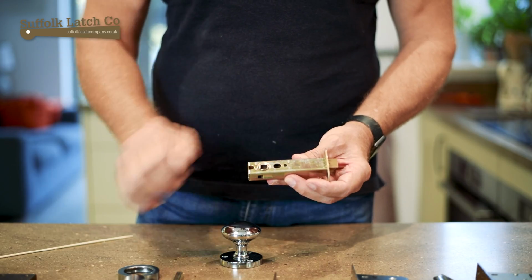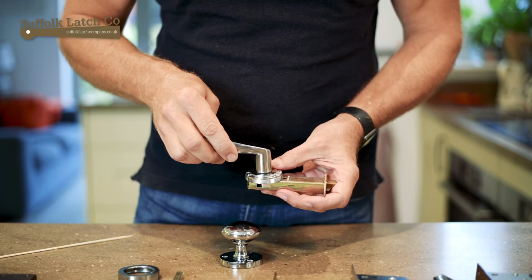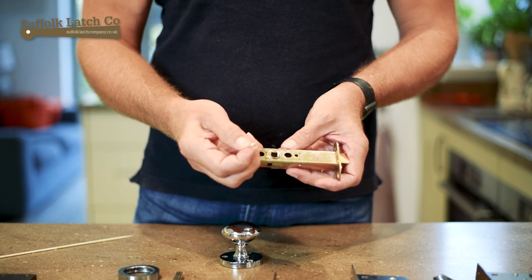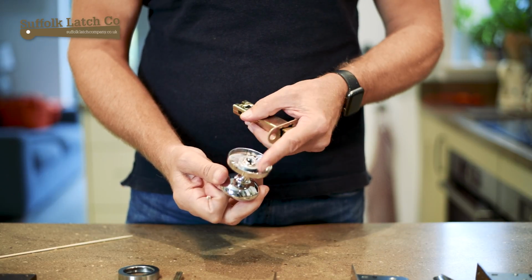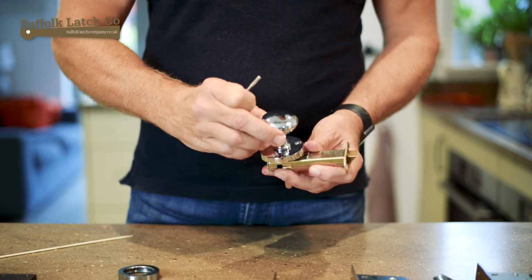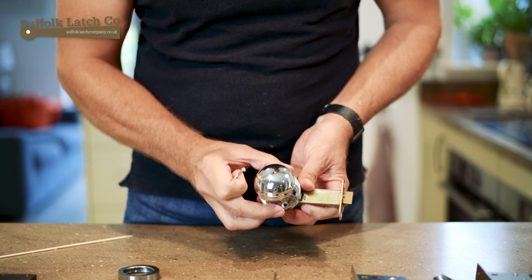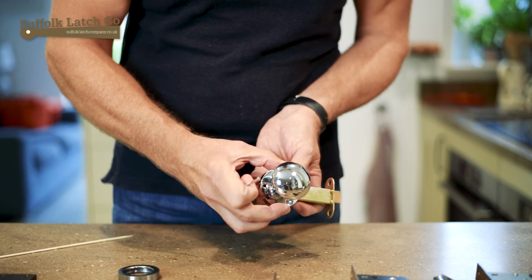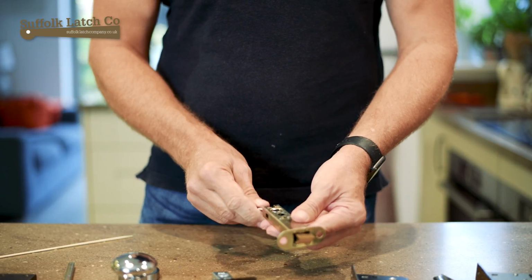Now the idea of a bolt through is, if you operate a lever on rose handle, you actually bolt through these two openings with something like this, which in effect clamps the two handles or knobs either side. You'll notice with this one here, often with round doorknobs, you have this 3-hole configuration, and when you start putting it together like so, you start to notice that the handle itself operates in the same way, where the two fixing holes bridge either side of the tubular latch, and the whole side here actually bolts through. That's really important. Okay, so going on from there, so bolt through connection.